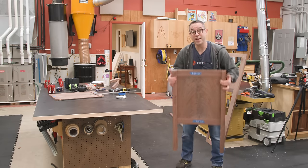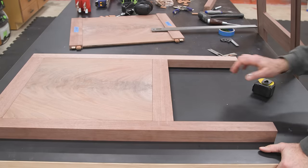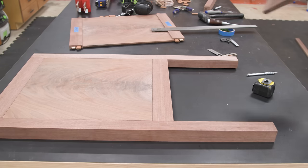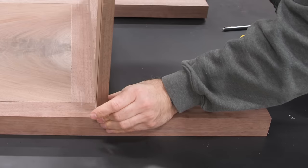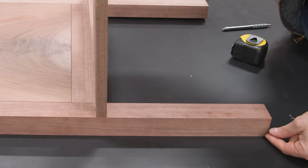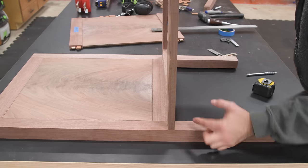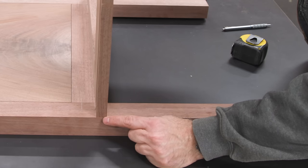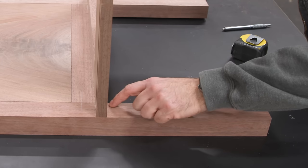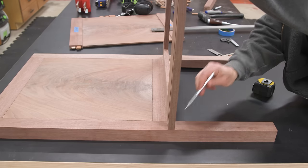Next we need to add a taper to the bottom. The taper basically starts at the foot and ends up at the underside of the web frame. If I drop this in place, this guy will be flush with the rail and flush with the front. Our taper is going to run from that point down to the bottom of the foot, where we leave ourselves about an inch at the bottom. We have to be very careful not to go any further — if the taper goes up too far, it's going to cut into the intersection point with this piece and there's going to be a gap. So if you have to, stay away from the line and finesse to the point that they meet perfectly. It's not a bad idea to draw a line — that is your no-go pass point.